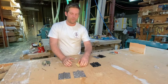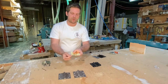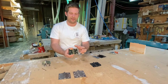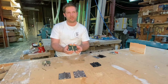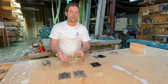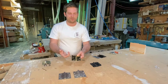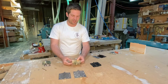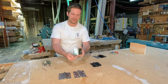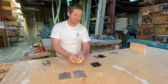thing. When it comes to the renovation industry, you can deal with square corners on like the frame, and then this is a 5/8 radius hinge on the door. So you can flip-flop this between door and frame. And that's just so that things are set up differently. It's an adaptation to allow the homeowner or a retro job to have the perks of both without having to rip out the jamb to match it. So if this is set up the wrong way, what you can do is you pop the hinge, and then the head of the hinge, you can flip it around so that you get the proper orientation on each side.